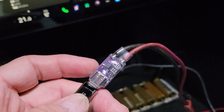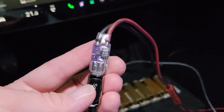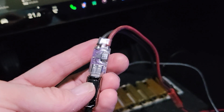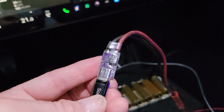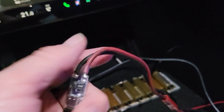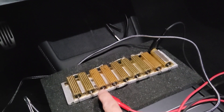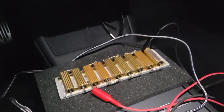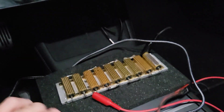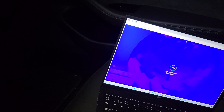This decoy board communicates with the USB port and tells it which voltage it desires. USB-C Power Delivery works like a level 3 EV charger — the device tells the charger what voltage, current, and power it can take. This board is set to request 20 volts using a dip switch, and I will use seven 1-ohm resistors in series for a total of 7 ohms, giving about 60 watts at 20 volts — the maximum voltage these USB-C ports provide.